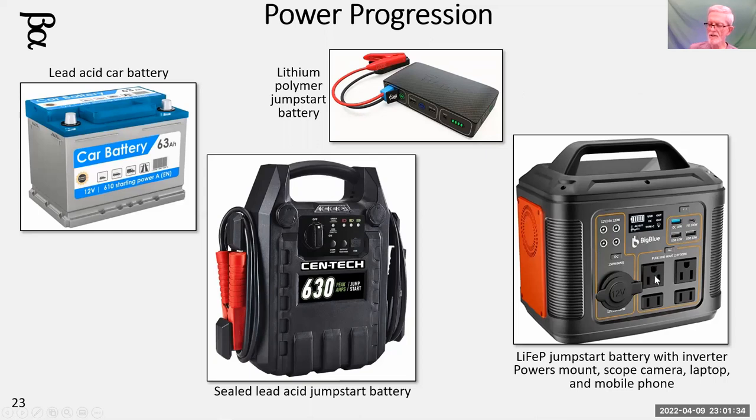On your normal loads, this will give you about 8 hours. Of course, as soon as you start doing things like, instead of getting a low voltage adapter for your laptop, which normally runs at 19 volts, you want to power it by 115 volts AC at 3 amps, that's obviously going to put a bigger draw on it. But if you get a 12 volt adapter for your laptop and your mount has a 12 volt barrel adapter, you just need a 1-to-1 barrel plug to barrel plug. And now you can run it for 8 hours.